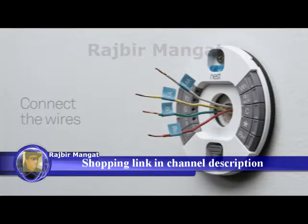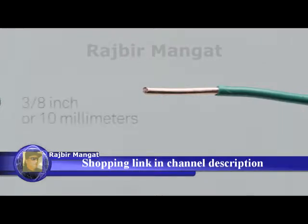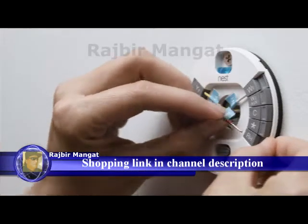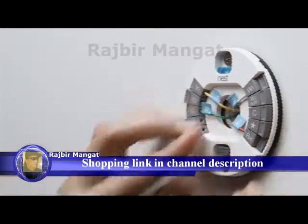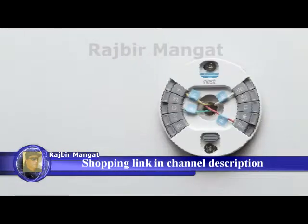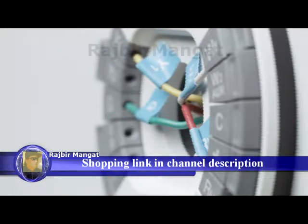Now it's time to connect the wires. Check the ends of your thermostat wires — they should be straight. If not, re-strip them and trim the ends, leaving 3/8 of an inch or 10 mm of wire exposed. Insert each labeled wire into the matching connector by holding down the connector button and pushing the wire all the way in. Make sure the connector buttons stay down after inserting each wire; otherwise your Nest thermostat may not get enough power. Only put one wire into each connector, and don't connect any wires that weren't connected to your old thermostat. Push the wires in so they're flush with the wall — this will help the Nest display connect to the base.